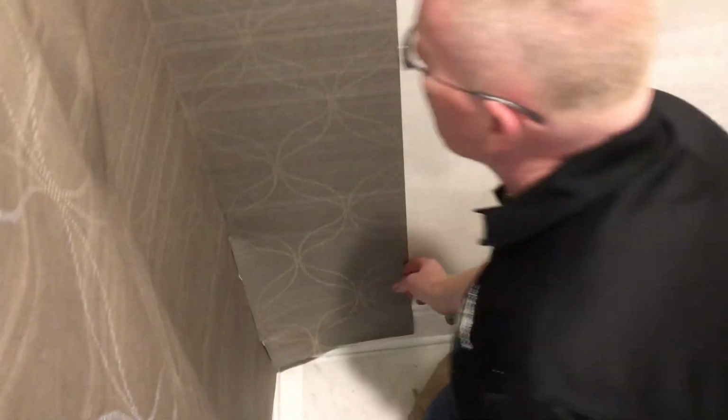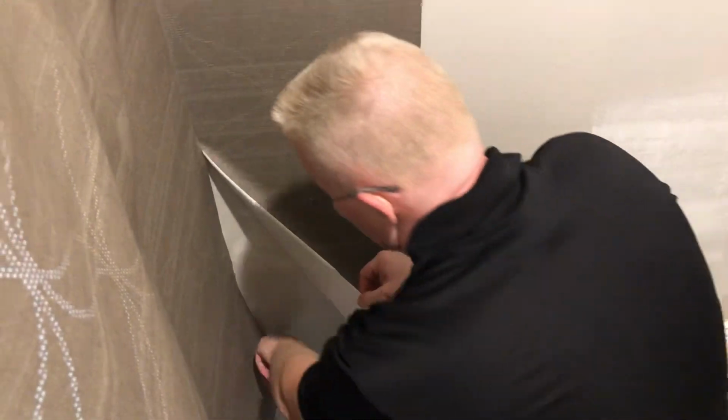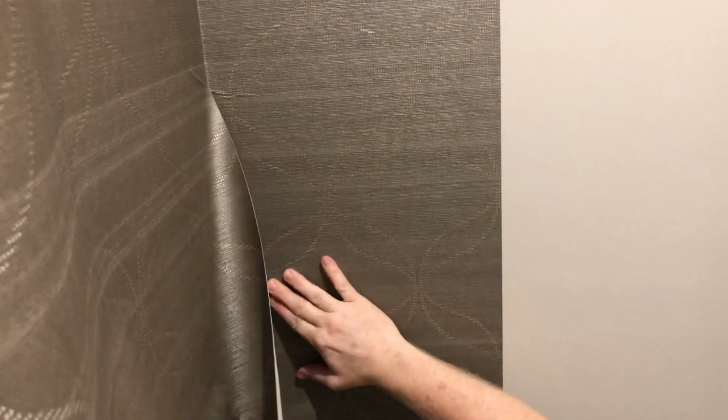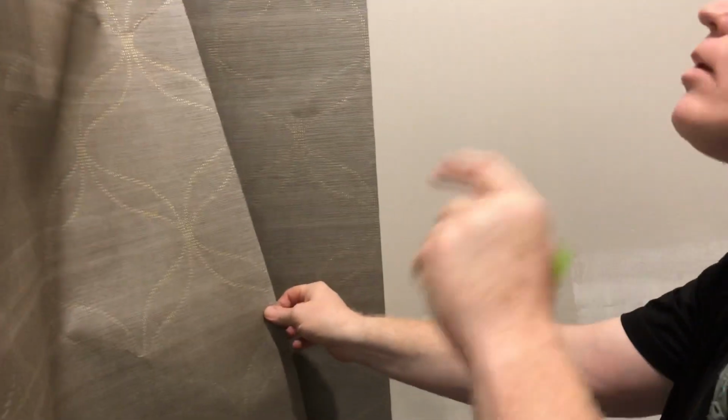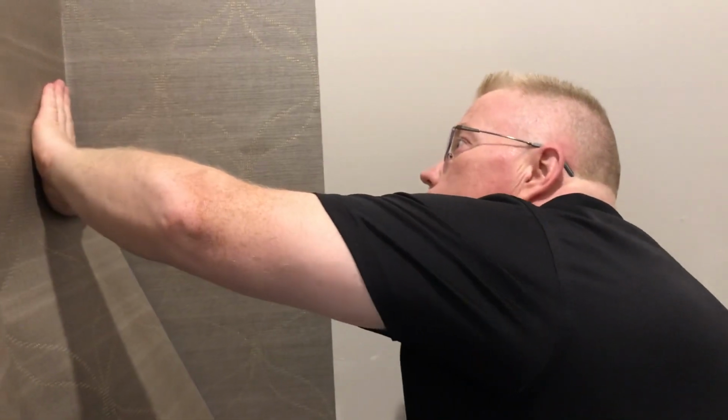It's unfortunate, but hey. So I'm trying to tell you when to cut. When I started hanging paper, people were like, just cut it all the time. That's ridiculous. You lose something when you cut. First of all, you lose pattern. I don't care how small the cut is, you're going to lose part of the pattern. But in today's day and age, you take pictures. You're working for people, they say, oh, you cut my wallpaper, you weren't supposed to. So, no, a lot of people don't understand this very important thing about corners that are off plumb. They'll say you messed up their pattern. Some people, not everybody. But you have to be able to understand why you cut it and why it was necessary, all right?